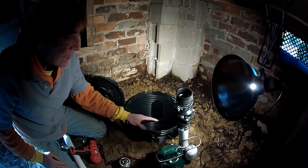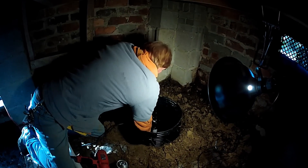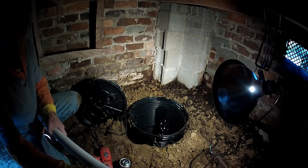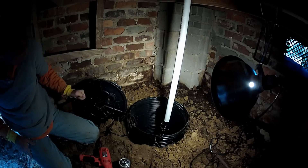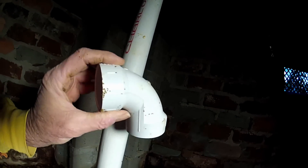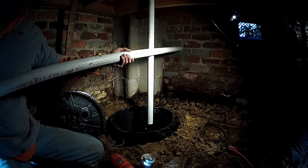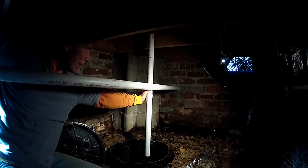The sump pump will lift water out, then we're going to drill right through that wall. We're ready to plumb our sump pump down into the pit — first we'll put it in to make the measurement. We'll set the pump down in the pit, stick a piece of pipe on here, and check how much to cut. Basically we want to come up from the sump pump through the check valve and put a 90-degree fitting right here, then go right through that wall. When you make your measurement, you can see we're going to have to make a cut somewhere about here where we're throwing the 90 on — so mark it with your thumb and put a mark on it with your hacksaw.